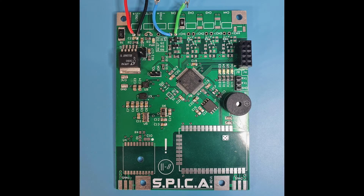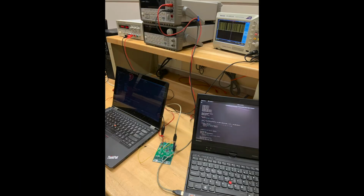Spica is our student-researched and developed custom flight computer. It is used for data collection, and when used with the ground system, streams telemetry live so we can monitor and track the rocket during flight. It has an ARM Cortex CPU and several sensors, including an inertial measurement unit, barometric altitude sensors, and a GPS. The data can be streamed live to the ground using a 900 MHz transmitter that is received by a second custom PCB on the ground.